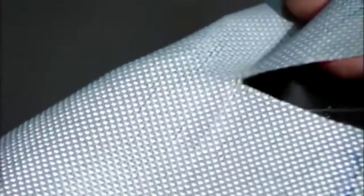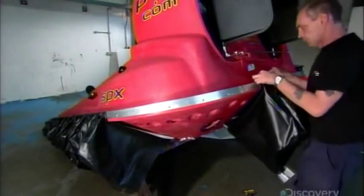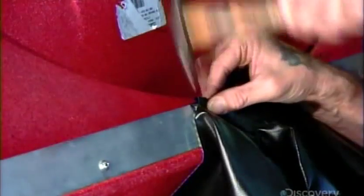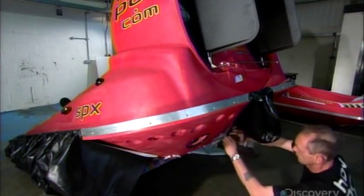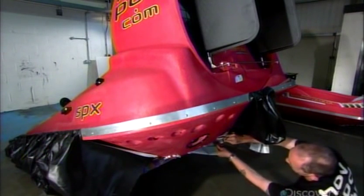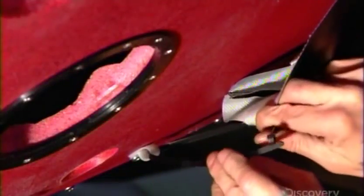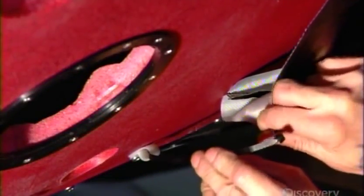The hovercraft skirt is made of the same material used on shoe soles — sturdy polyurethane nylon. They assemble the skirt to the hull in 65 different pieces. The worker loops each segment over a side bumper and secures it with a steel clip, then attaches the bottom of each skirt piece to the little hooks on the hull.